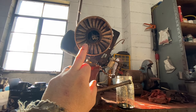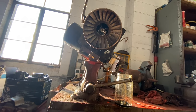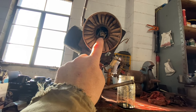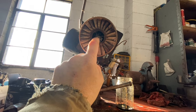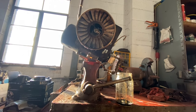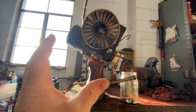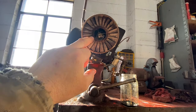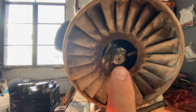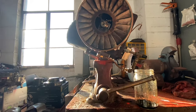Here's the burner head, and behind it is a block - I'll try to include some still pictures in the video. Behind that is the block you also buy from CK Burners, or some people have made themselves. That is what's preheating the oil right at the nozzle. You've got the nozzle itself right here, which has a venturi-style head that's aerating the oil and shooting it out in a fine mist. Behind that you can see the aluminum block that heats it, with the temperature probe. And these are your electrodes right here - they're arcing against each other, which lights your mixture on fire.